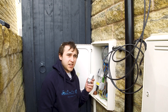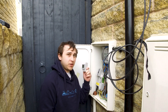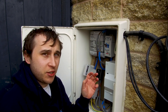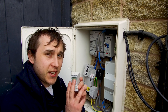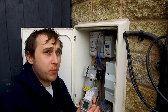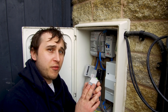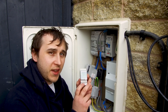If you purchase the Power Boost additional accessory at the same time as your Pulsar Plus, your engineer will put the meter just after your electricity meter, because it keeps an eye on the entire house supply. It's very important that it's installed directly after the meter, before any splits in your tails — meaning before it goes to the EV charger and to your house. When EV charge points are installed in the UK, the engineer commonly splits the tails into what we call Henley blocks — one goes to your EV charger and one goes to your house.